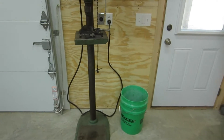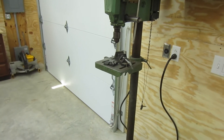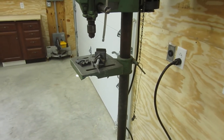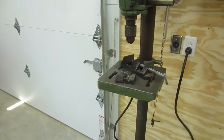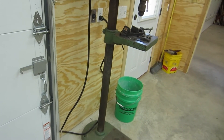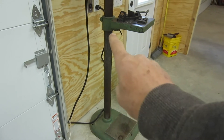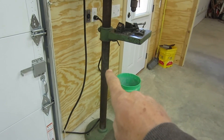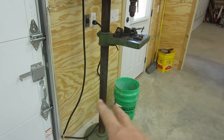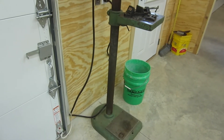This is my attempt to put a crank elevator or riser on my drill press. It's just manual right now and it's pretty heavy and tough to get where I want it. I had seen some guys taking a trailer jack and adapting that, and I'm going to try my own version. Everyone I've seen has the handle down at the foot, but I don't want to reach down that far, so my version will be flipped with the handle up where I can reach it.